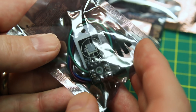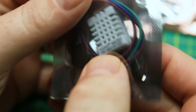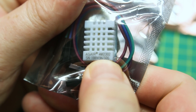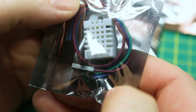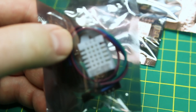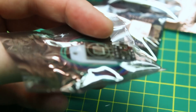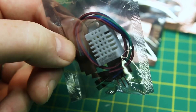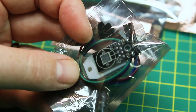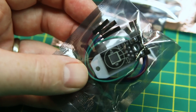Standard humidity and temperature sensor. This is the AM2302 — I've never used this particular one before. It looks an awful lot like a DHT11 or DHT22, but we'll give it a go. I bought a couple of different styles because the DHT11 does have accuracy issues, so I thought I'd try a couple others. These are handy for home automation projects and just about anything — really good little temperature sensor, and you get humidity for free.